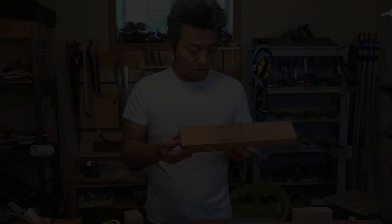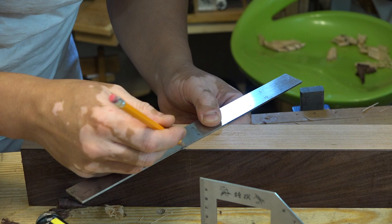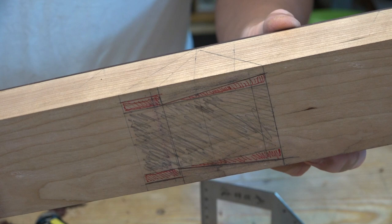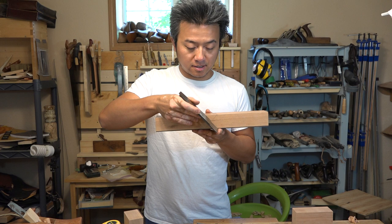I've laid out all the parts of the plane and all the places I need to cut out on the top and on the bottom. The details are in a link in the description explaining exactly how to make all the measurements. One distinguishing feature of the Chinese plane is that the blade is offset from center, so the front of the plane will look bigger than the back.